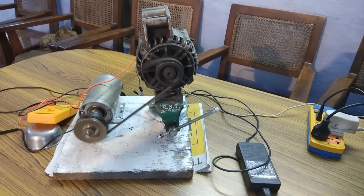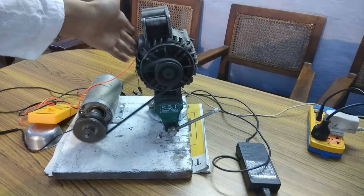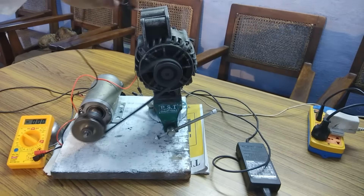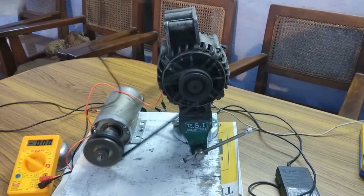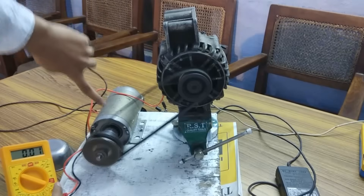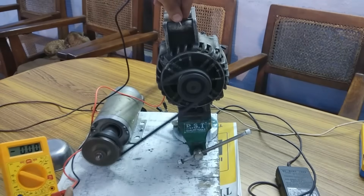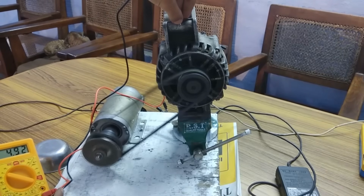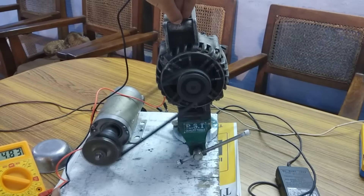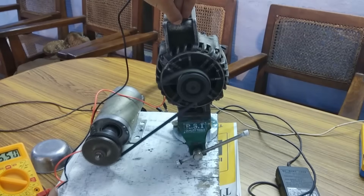Now let's measure the voltage generated by this alternator after we have disconnected the mobile charger that was exciting the rotor. The entire body of the alternator is the negative, so I'm going to touch this terminal to the body and you should see some voltage reflected. It will not be 12 volts since I'm feeding this DC motor only 35 volts and it has to operate at 100 volts. Let's see — yeah, it is 4.84 volts. Yes, it is self-excited; it is generating electricity without the mobile charger connected, and the voltage is shooting.